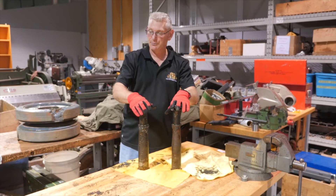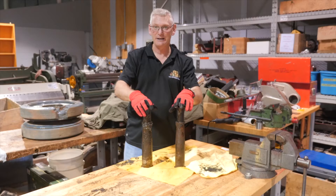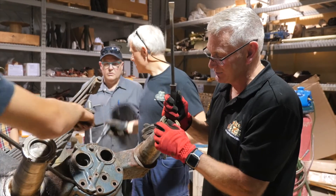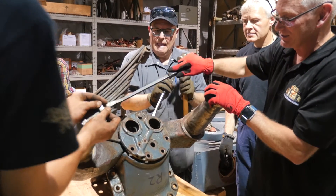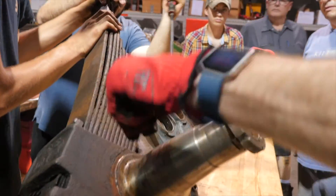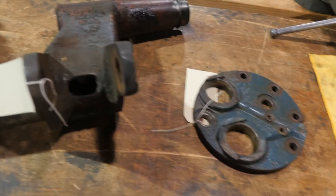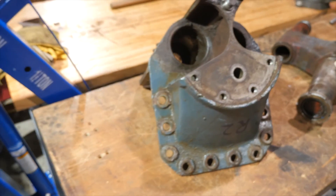So we've got these here and we're now going to bring the support arm and the rest of the suspension over — we've got to be careful because there are no pins holding them on. We'll get them on the bench and take them further apart. We're using the pry bars to get this cap off so we can pull these support arms off — just wiggle it slightly. My concern is when we do this it's going to come off and go that way. It's almost out — looks like it's bound on the bolt. What they suggested is that we heat it up.